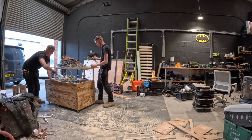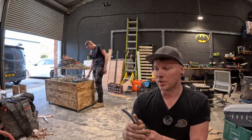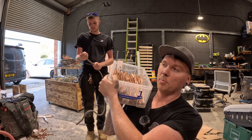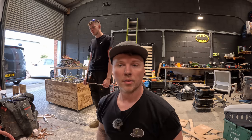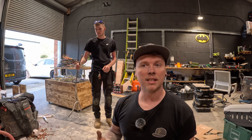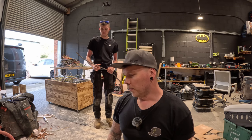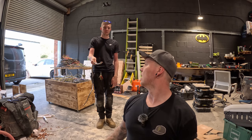Normally if you watch our past videos, anything like 25mm like this which is easy to strip in a cable stripper, we would strip it down with a cable machine and turn it into this, so I could smelt it down and make ingots. But with the price of gas at the moment it's not cost effective — converting this into a copper ingot isn't worthwhile. I always planned to stamp a logo on them and sell them as limited edition merch, like one of ten, but I've still not got around to it. I've got over 10 bars made. This 10mm stuff — we're just going to scrap it all.